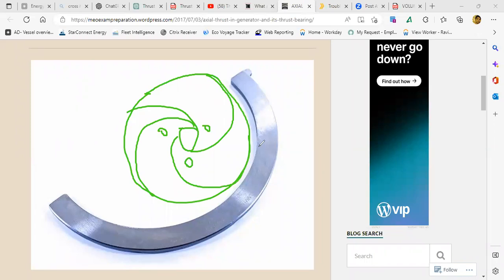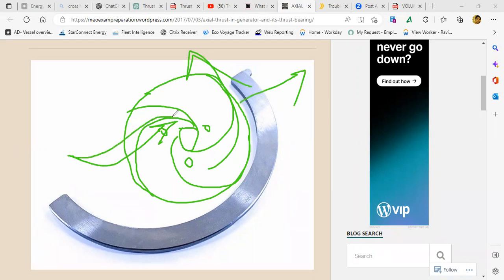What is the purpose? So when the pump starts and starts pumping, the water is pumped out. So you have a suction pressure on one side and discharge on the other side. Correct? A tangential discharge. When the water flows in this particular direction, into the eye of the pump, the pump is going to lift. That means the whole shaft is actually going to shift, with the seawater pressure, and then it starts rotating. But that shift, who is going to balance?